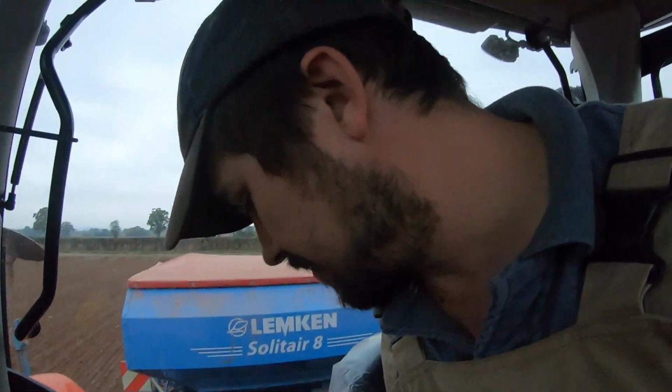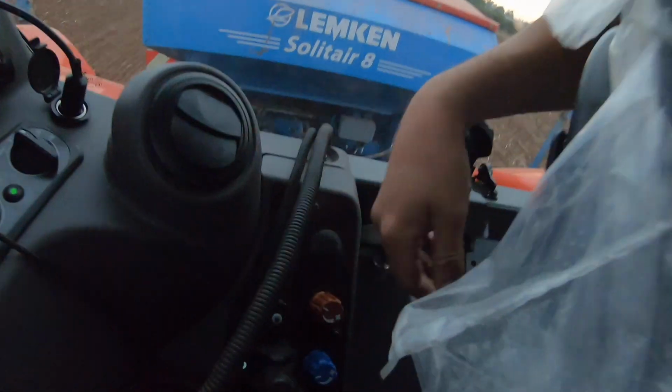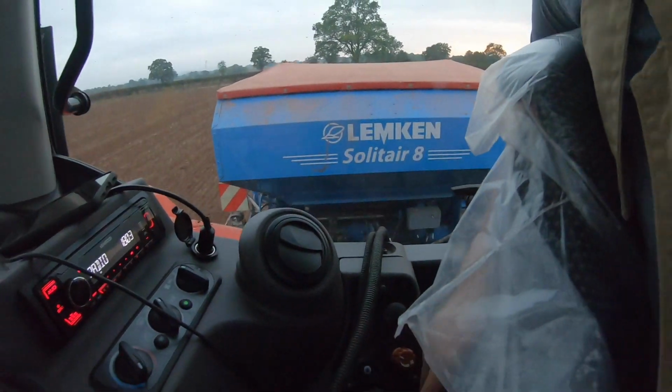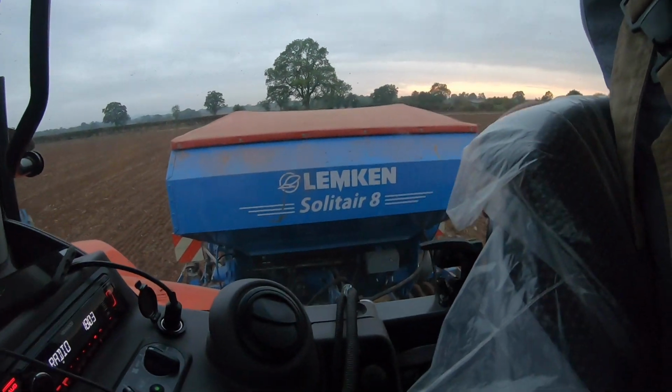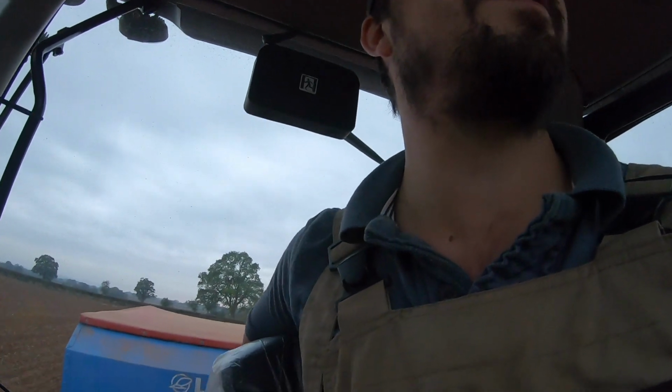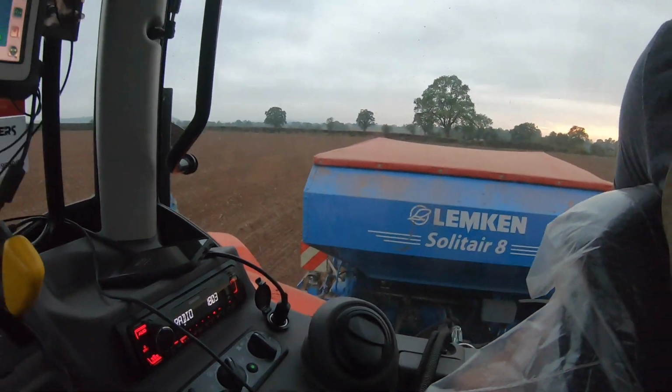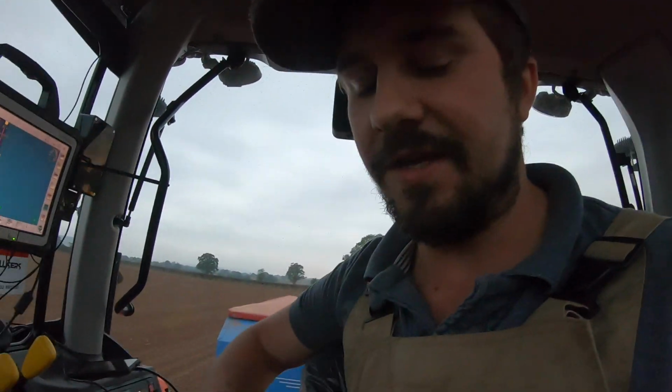Another quite nice feature we've got is controls for oil flow from within the cab. Forgot to drop my marker on. So that's pretty good. On the John Deere you could reach out the window, and there were some little adjusters on top of the block, but yeah, it's quite simple. I think all it is a little cable, but yeah, it's a nice little feature to have.